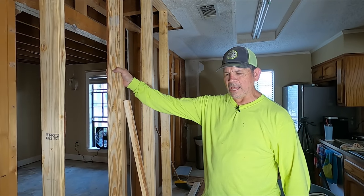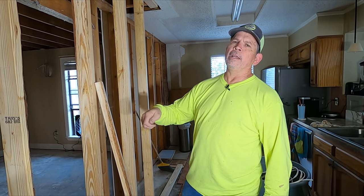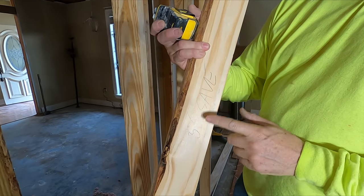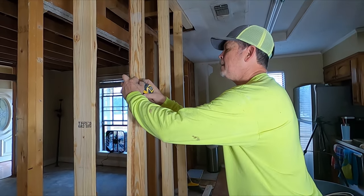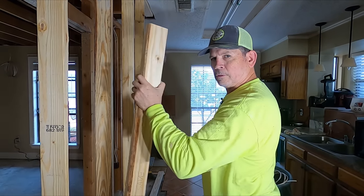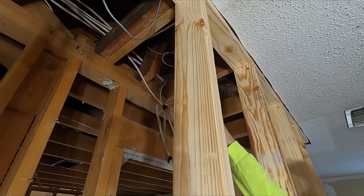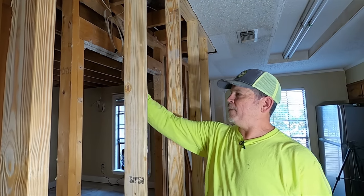All right gang, you saw us get this wall up in the time-lapse — that was quick. We used the pneumatic framing nail gun. A lot of people like to use screws — it's just your choice. I find it's easier to pop a nail in there and pull it out later. We also used a stick that's exactly five feet long — marked 'save' on it so we don't use it for something else. I put it on the bottom plate, put the top of my tape up there, and just add five feet to the dimension — that way I'm not on the ground trying to read a tape measure. Good tip to save your back and knees. Our last step is to jump in the attic and move those two braces supporting the roof, then we can remove this wall.